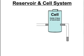Now the SMAC booster that I have with the 4-inch PVC pipe holds 2 liters of electrolyte solution. And basically what I've been running in the past is 2 liters of distilled water with 2.5 teaspoons of the drain cleaner or sodium hydroxide. It's that Roebic drain cleaner, which is working pretty well for me.